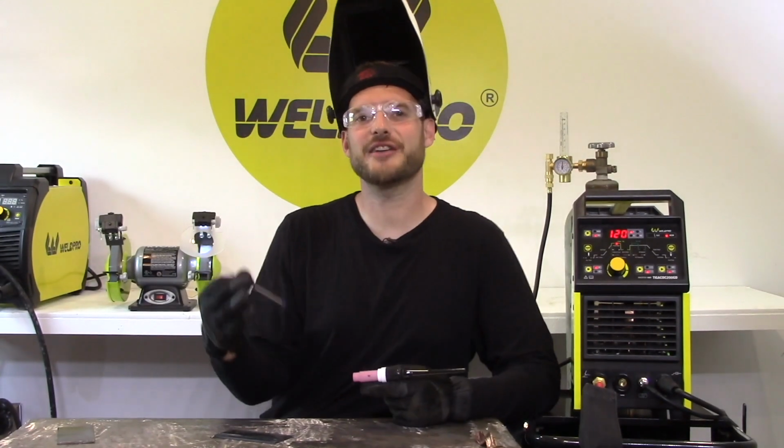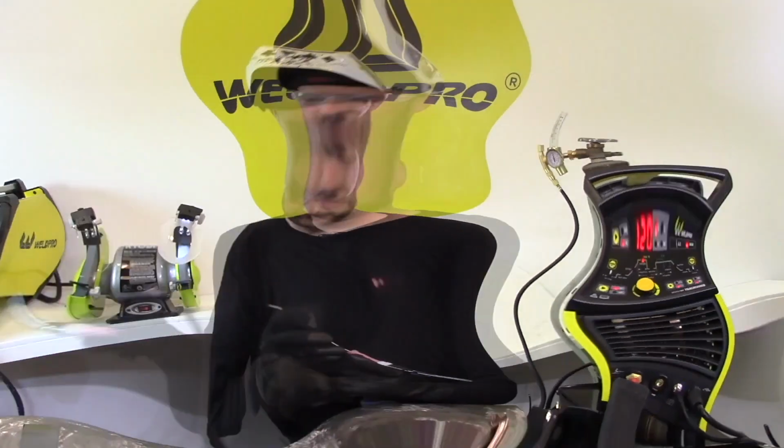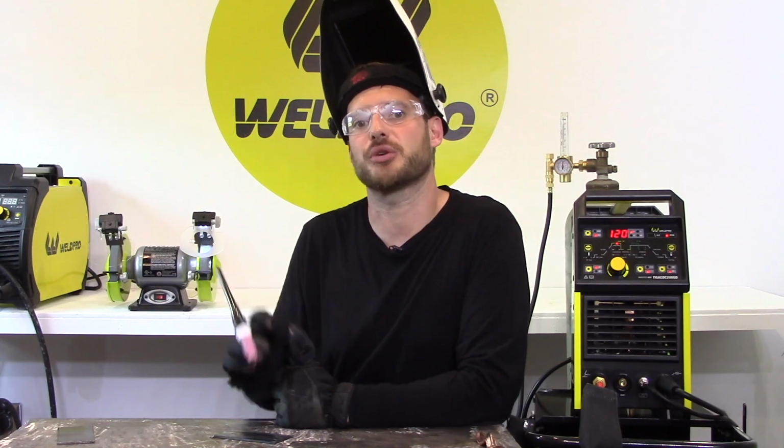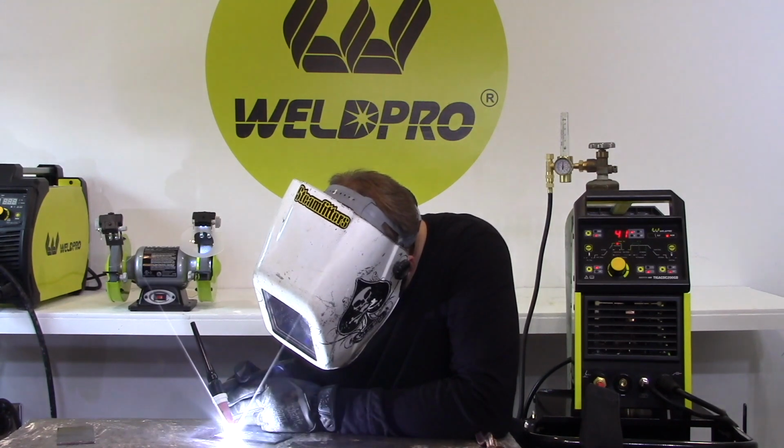All right, now that I've reground my tungsten, I'm going to go ahead and slide it back into my torch. Let's go ahead and finish up that pass where we stuck our tungsten. We'll tie into the spot where we just ground out.